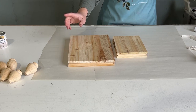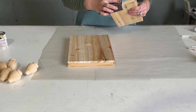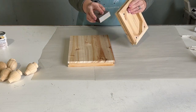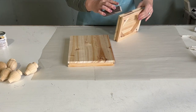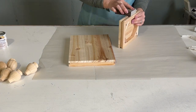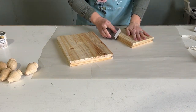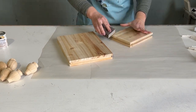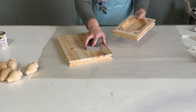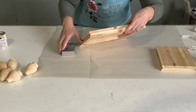Very first thing before we start: take your sanding block and sand all the edges, just make sure there's no rough spots — give it a good sanding on those cut pieces. It doesn't take much effort but it sure makes the finished product look that much better. I did sample some stain right there so I'm sanding that back off. I'm just going around the top sanding that edge, keeping it nice and smooth, and then I wipe it. Sand any spots that need a little attention — just sand that.